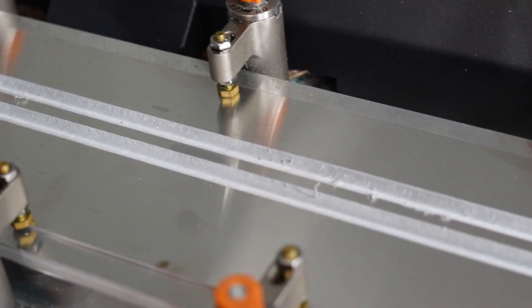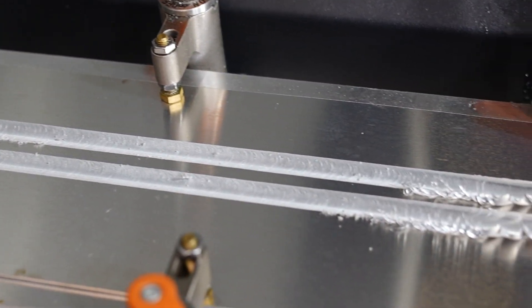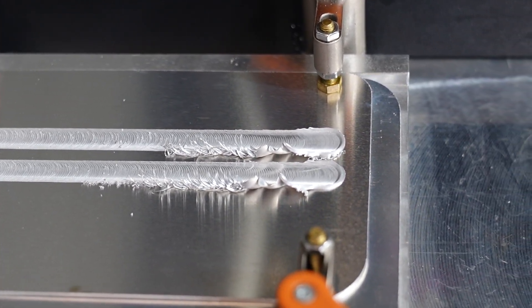You can have multiple tools in the same tool magazine. The idea of our design is that we can weld at a B0 position, which isn't very common in these FSW machines. What do you mean B0? Basically you're perpendicular to the piece, whereas commonly you would have to have a tilt, which is how they kind of iron flat the weld.